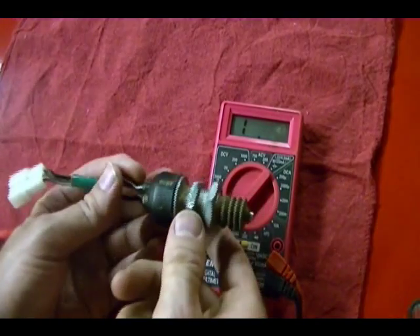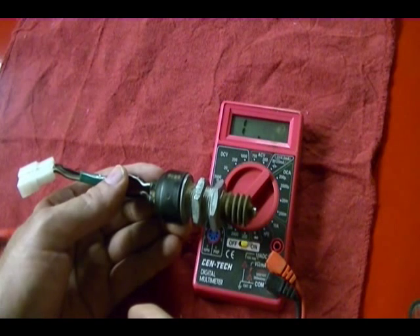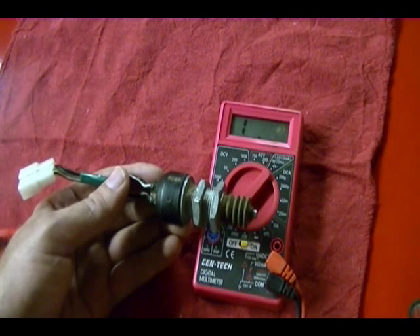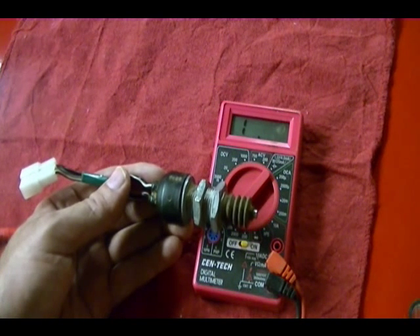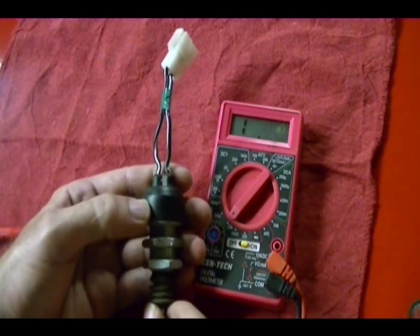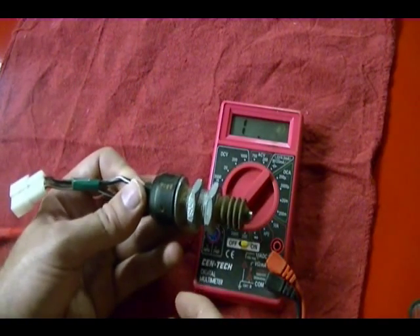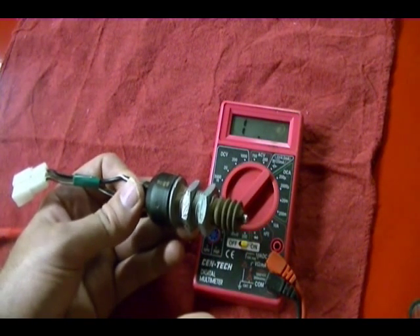It's possible to have a single body with multiple switches inside and more than two wires coming out — sometimes there's really no way to tell the logic of the switch without having a repair manual. That's the ideal situation, to get a description of the switch and see how it actually fits into the electrical circuit on the tractor. Sometimes they write NC or NO on the switches so you know right away if it's normally closed or normally open. I'm going to go ahead and reinstall this and get the tractor out. I hope you found this video helpful — thank you for watching.